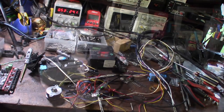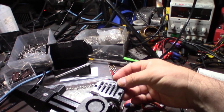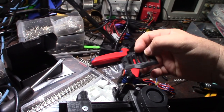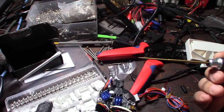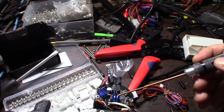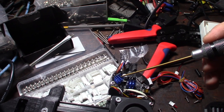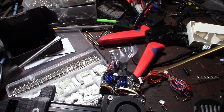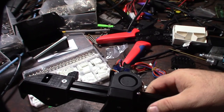Here is the EBB36 added to my extruder system, and here's the fan cover so you don't see the open PCB. It's open-air to allow airflow to get to the components. Some videos I've seen show people adding a heatsink to the CPU, but the heatsink should actually be on the driver — that's what's going to get hot from constantly driving the extruder motor. I'll put a link on my Thingiverse page if you want this design.